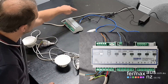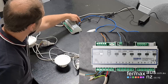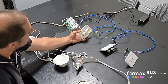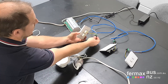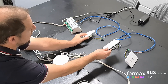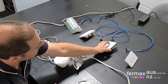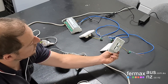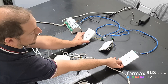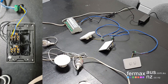We've got our line neutral going to our power supply and our switchboard. Then at the top we've got our switches, which are just daisy chained using blue and white into the back of the switch. One difference here is that these are no longer light switches — they're push-button mechs. We've just used a cat cable and we've looped in and looped out blue and white into the different switch mechs. And it can be any push-button switch mechs — as you can see, they're all three different designs. As long as there's a push-button mech that goes into this little module here, we can control it and use it.